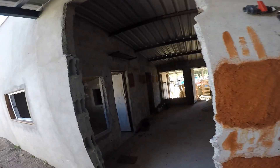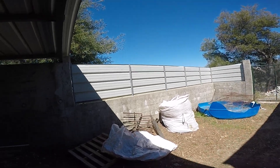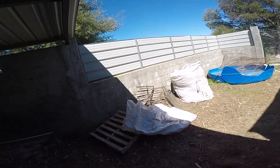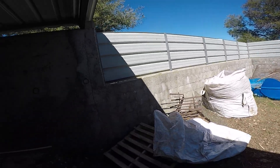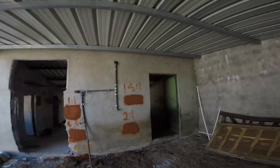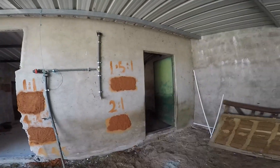We've done four different mixes on four different surfaces because it might end up that we do a one-to-one in here but a two-to-one there. You can see it's getting direct midday sun, so in this case you'd put up some sort of tarpaulin to stop the sun hitting it directly. If it dries too quickly it can separate between the wall and the render and just fall off. If you have a mister, mist it with water during the day while it's drying — it'll help it dry more slowly. Like cement, the slower it dries the harder and stronger it gets.